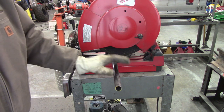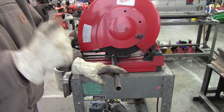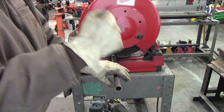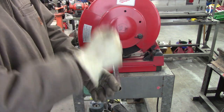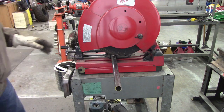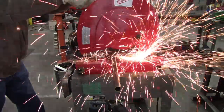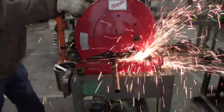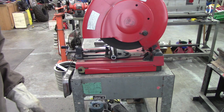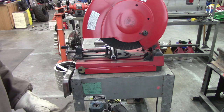If you want to build one of these, you can go to Home Depot or Lowe's and get a 12 inch piece of three-quarter inch pipe, already threaded on both ends, and put caps on it. What we're going to do is put about half this pipe full of lead shot. When you're doing the hand crush to make it fine, that shot's going to be working up and down inside — as you're pounding, the shot moves and comes down, giving you more impact on your material. Let me fire this up and get the Milwaukee here to cut this.